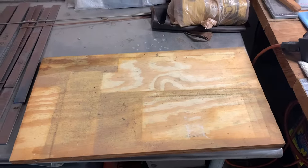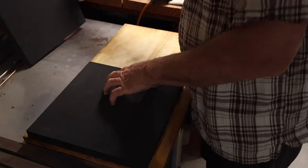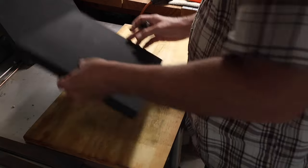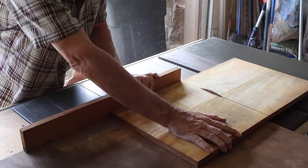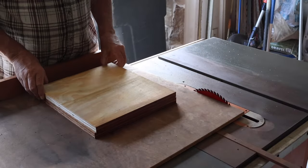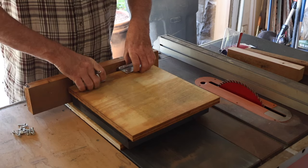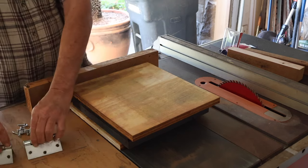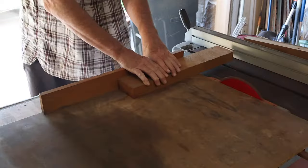I picked up a piece of scrap plywood, about three-quarter of an inch thick by maybe 12 by 24 inches wide. I picked up some one-inch foam off Amazon — I think I paid about $10 for two pieces. If any of you aren't familiar with Kydex, it's a thermoplastic, so you heat it up to about 375°F and it becomes soft and pliable and you can form it. A lot of guys use it for knife sheaths or gun holsters, but you need a way to press it into shape — either a press or some sort of vacuum system that'll pull the Kydex into shape.